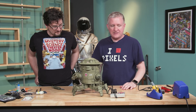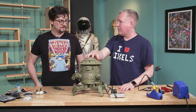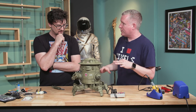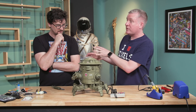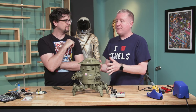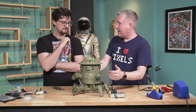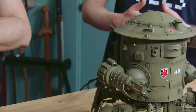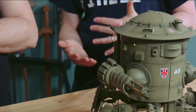The designer Michael Singh already released the source code, so I downloaded that and inserted some code to control the smoke, because you don't want it running constantly — you'll overheat the e-cigarettes. I have it running whenever the robot walks, for five seconds on and then five seconds off, until it stops walking.